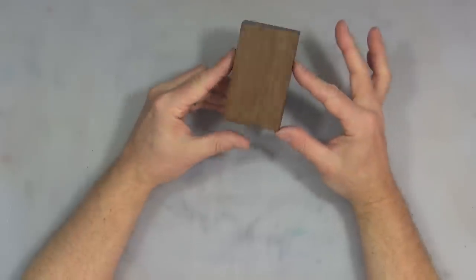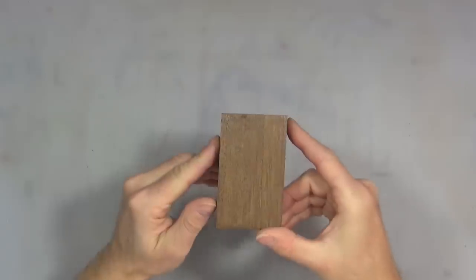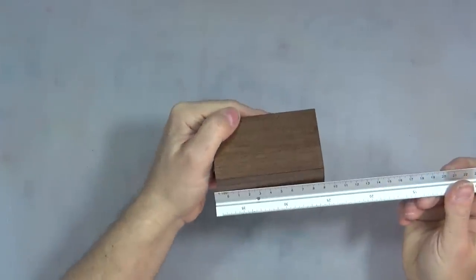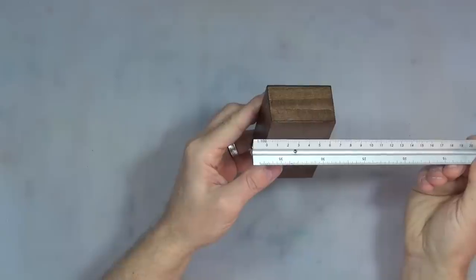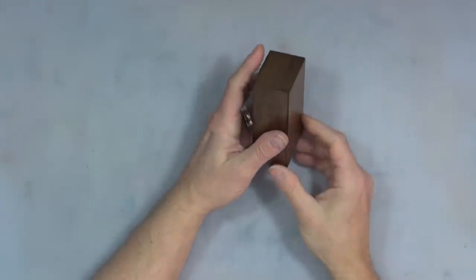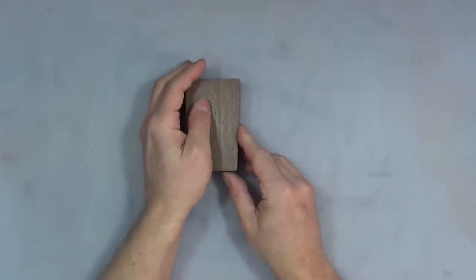You could do any color you want — candied apple, fossilized amber, whatever — but I've gone for wood color because it's wood. It's obviously shiny because it's had three coats of polyurethane varnish, water-based. The reason I use water-based is I don't have thinners in the house because it smells funny and the dog won't like it. It's also more eco-friendly and you can just wash your brushes in water. The size of the box is 10 centimeters by about 60 millimeters, with a depth of about 40 millimeters.